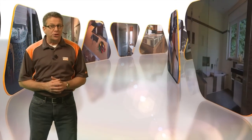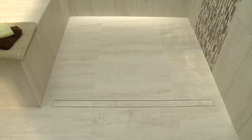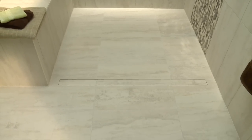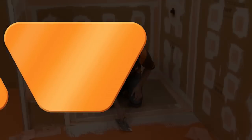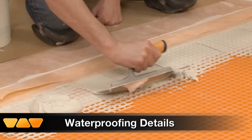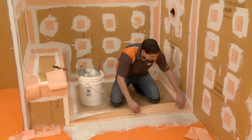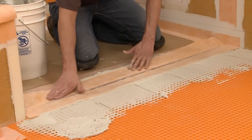The final step in ensuring both the wet area and drying area are totally waterproof is to install KERDI-BAND at the seams of the Ditra and install the KERDI collar around the KERDI-LINE. Ditra can be made completely waterproof with minimal effort. By completing the installation of the Schluter-KERDI collar on the channel body, the wet area and the drying area are sealed.